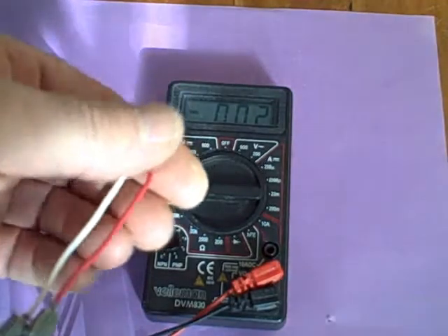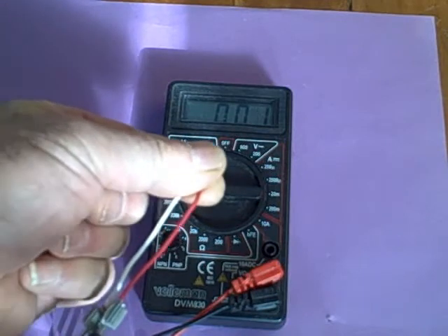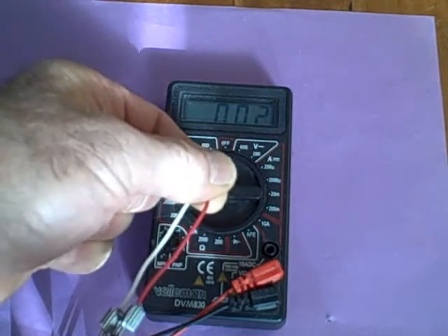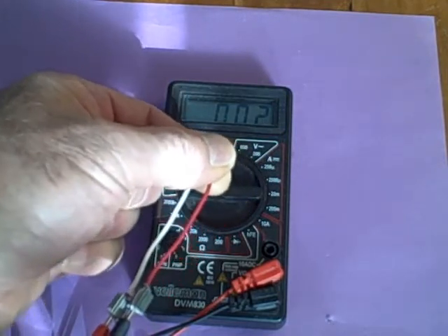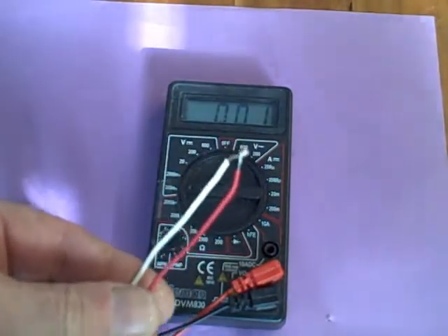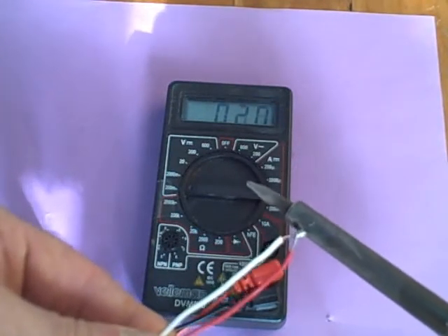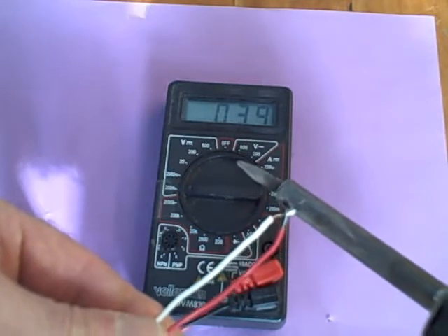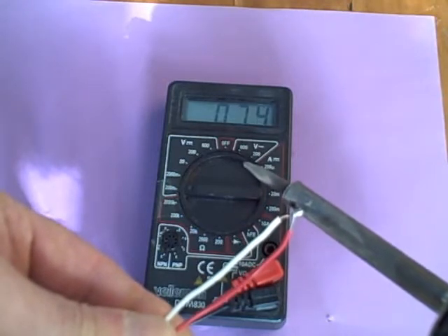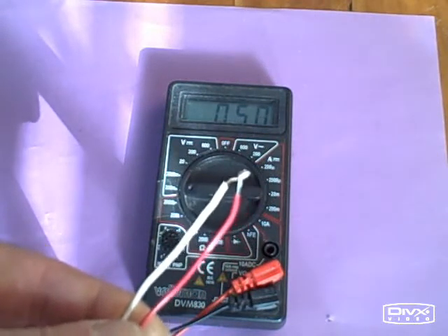The scale is so small. I'm going to add a little heat by putting my thumb on here to see if we can raise the temperature a little. Now it's up to 0.1 millivolts — not a heck of a lot of voltage coming out of this thermocouple. If I add heat from the soldering iron, you should be able to see the output voltage go up. We're already up to 3 millivolts, 5, 6, 7 millivolts. As soon as I take the probe away, the output voltage starts to drop pretty rapidly.